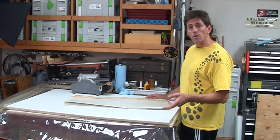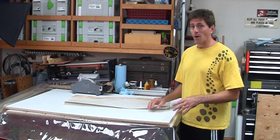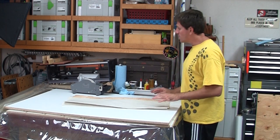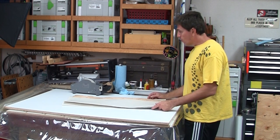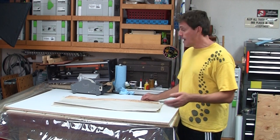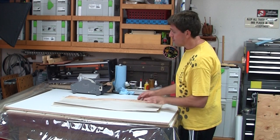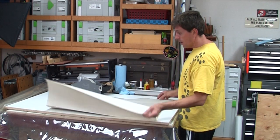So I've run a couple of the curly maple poplar panels through the bag already, and now I want to include this part of the burls on this video. So I just put a board on top of the bag so we can do a little bit of the visuals of how to do this four-way book match. Now, it's called the four-way book match, also called the book and end match. That's the thing where we open it up as a book in two places and then flip it over to get the fourth.